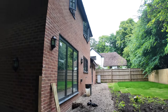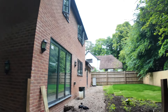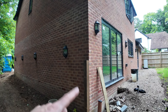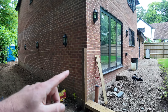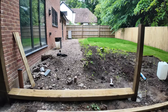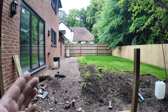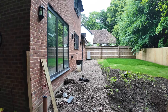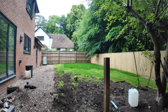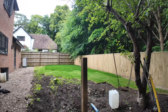Not worried about them being perfectly level - I'll work off this height and cut the piece from the other one, running it through level with no step. Just got to wait for the post-crete to set. That one I'm going to bolt against the wall as well, but I forgot my SDS drill, so I'll bolt it for belt and braces. I'll probably drop in another support behind the wall on this side since you won't see it - just to retain that patio in the middle. Just need to plumb these up as they set.